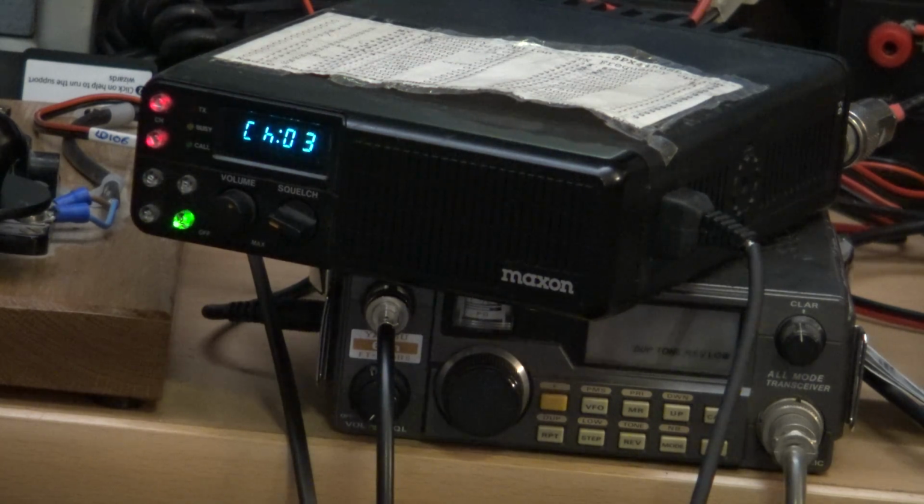So yesterday we did the 5 watt test with him going out there on 70 cm, which was a little better than half a watt. Well, it was better, wasn't it? Because we got him further on. So we did the half watt test, the 5 watt test. Then we had him come back with the commercially available quarter wave aerial, which is the thick one I mentioned, and it was better. And then today he's gone out still at 5 watts with the 5/8 aerial, and again it was better again. Then we've done a little repeater demonstration at 5 watts, and then he's altered his power to 10 watts, and whilst he was doing his shopping I had this radio on the bench because I had to manually alter it to 10 watts.